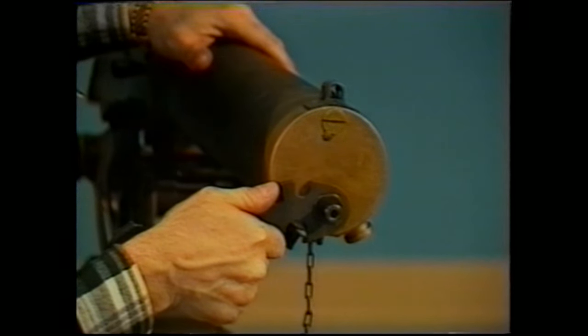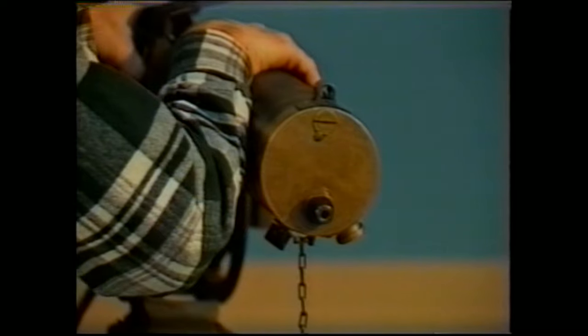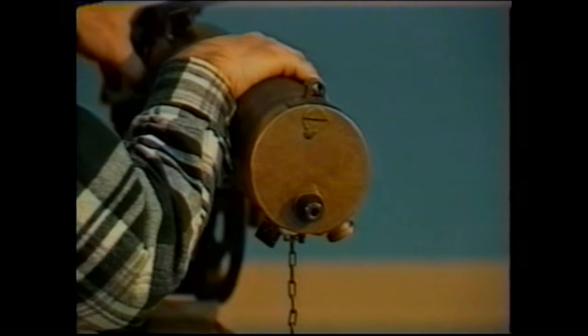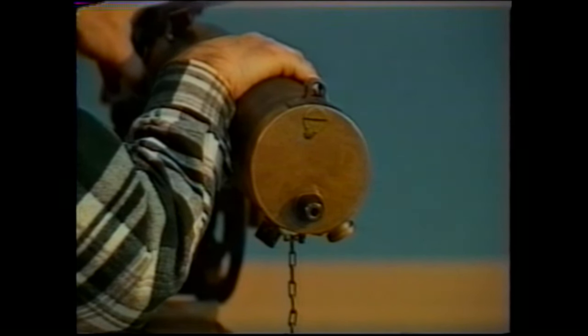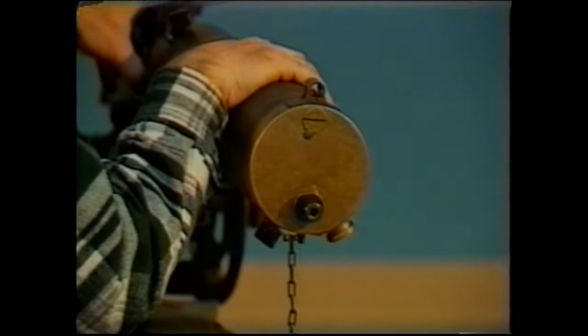If the leakage does not stop and you then begin to notice that you do have excessive tension on the barrel, then you must repack the gland. You've got your cord crossed, or you haven't put enough cord on, or you've done something else wrong.